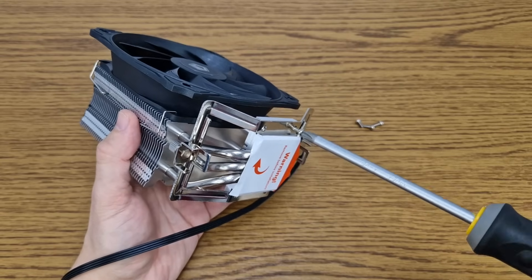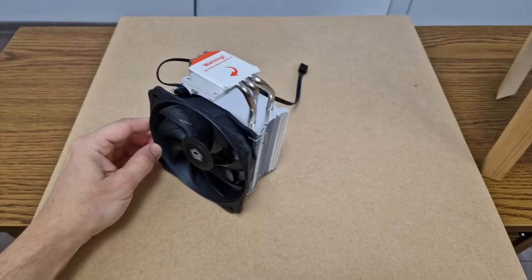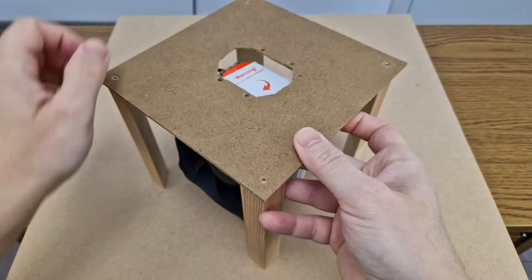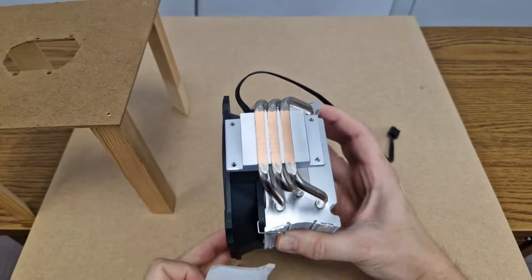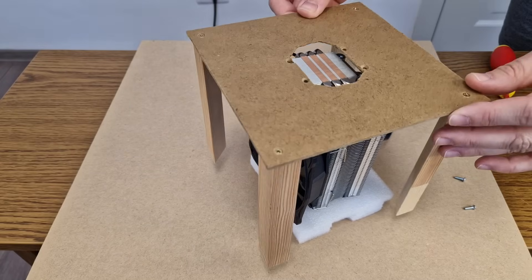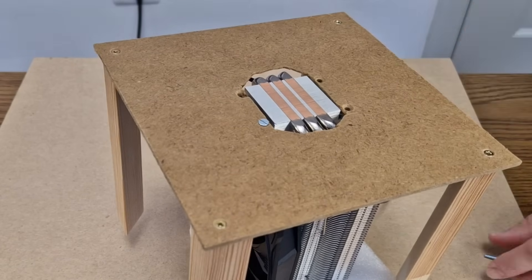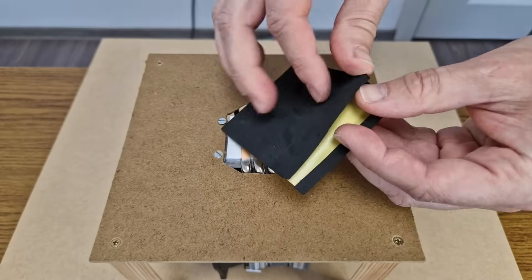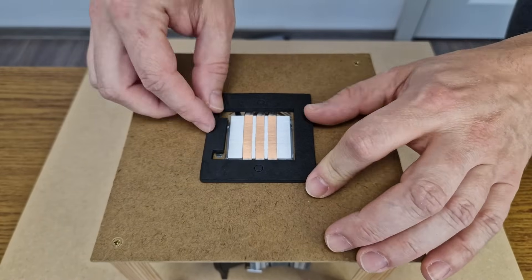The cooler needs some modifications — this bracket is not needed. To mount and replace the Peltier modules easily on the cooler, I made this small frame using a thin MDF panel and 4 wood legs. I added some washers under the MDF panel, because it needs to be at the same level with the heatsink. The frame with the cooler looks pretty stable. I will add sticky foam insulation to keep the module in position and to separate the hot side from the cold side.